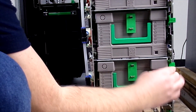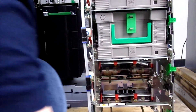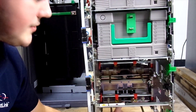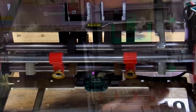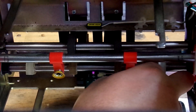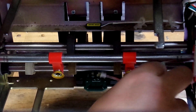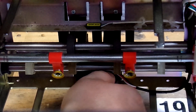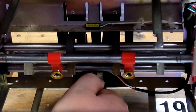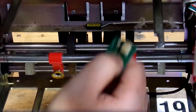I'm just going to remove this cassette so you can get a better view of what I'm doing — the engineers in the field won't need to do this. Your low note sensor is right here. I'll just change the angle of the camera so you can better see me changing it. Once you've got your cassette out you can reach in, grab the low note cable, give it a gentle pull and it just removes the connector. Then it is just a case of taking hold of your low note sensor PCB, gentle pull, and that should come right out.